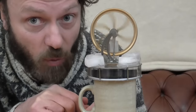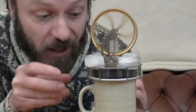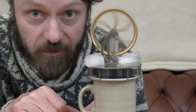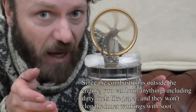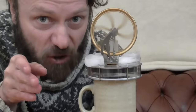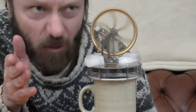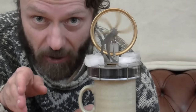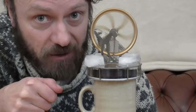So in the future, some of these might be used for what's known as combined heat and power. So either you have waste heat, which then generates electricity via the Stirling engine, or you deliberately create heat, which can also heat something else, like your home, to a comfortable temperature, and generate your electricity, which is all rather nice. And because they are simple and easy to maintain, they can be used at a domestic level. You don't have to make massive power stations out of them. And maybe that's another thing which is good about them, because a lot of other engines are very efficient when they're big, whereas these tend to be more efficient when they're small, up to about the 100 kilowatt size. So if it's true that the future is one in which we can have lots and lots of small power stations and people charging up batteries and then selling each other electricity on some complicated grid, then these could play their part.